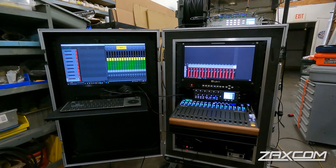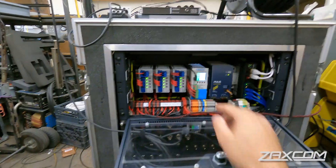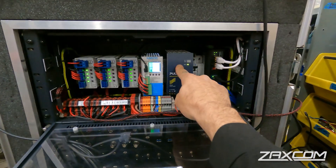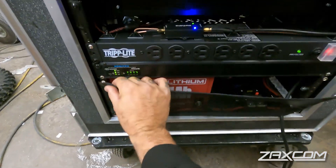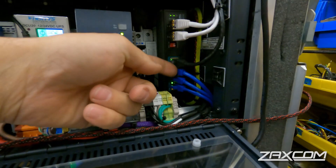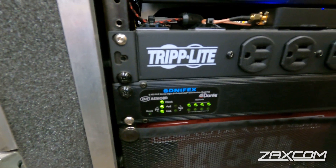For my application, I'm sitting in front of one of the newer carts from my shop — I call it the Warmonger. This is running the Diva 24 with the latest operating system, version 4.10. I custom-built a power supply out of all industrial automation components: AC power comes into a breaker, through a lightning arrestor, gets converted to DC, feeds into a UPS that also recharges a powerful lithium-ion battery. Then we have solid-state breakers and a series of Power over Ethernet ports.